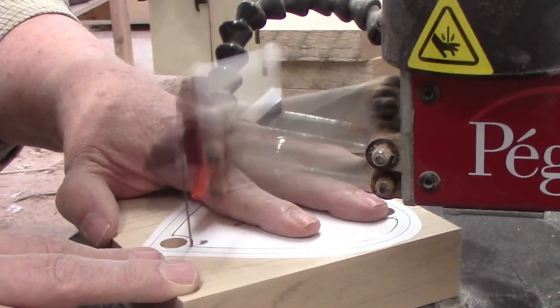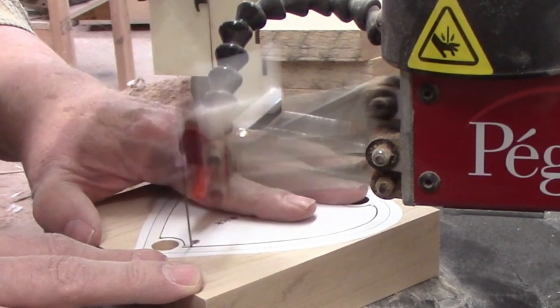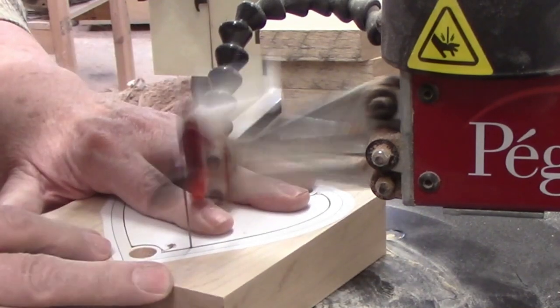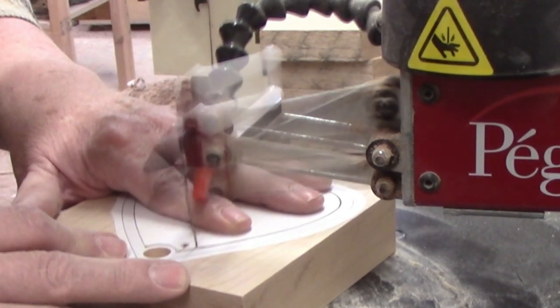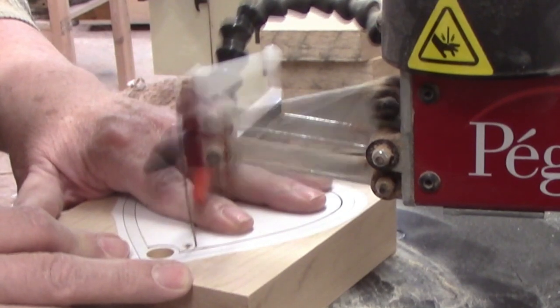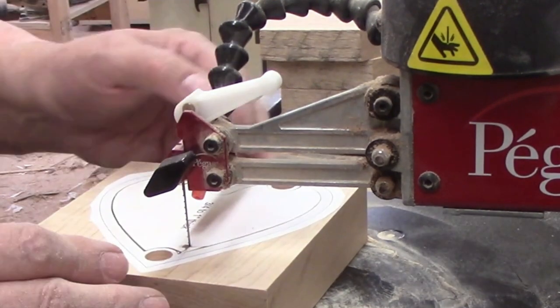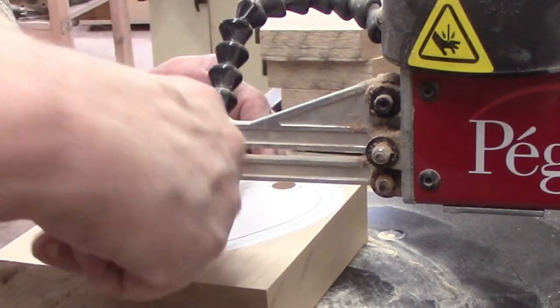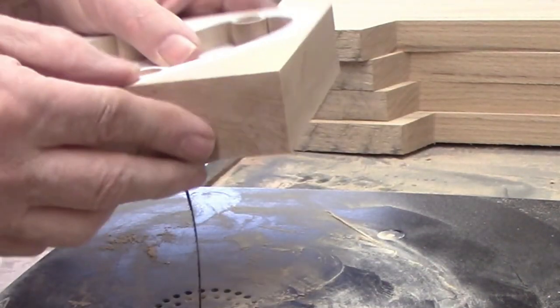I completed the long cut for the interior, and after loosening the blade, I removed the waste piece. I tried to push it down from the top and out the bottom, but it would only move part of that direction. It pushed out easily from the bottom up out through the top. This tells me I'd been putting too much pressure on the blade and it flexed, leaving me with an angled cut. Anytime this happens, you know exactly what you did wrong.